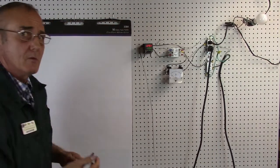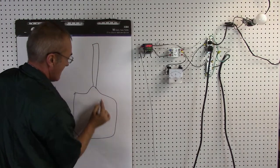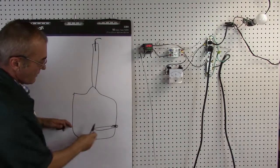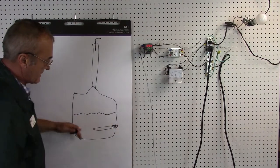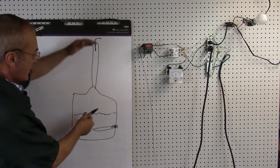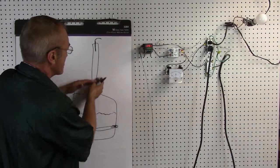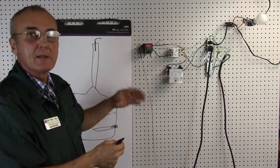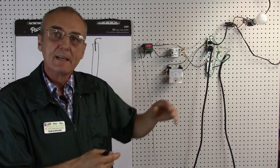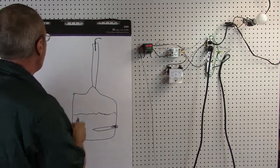It's much different if you put it into a still. If you've got a still with a column and a heater element, and you put your probe inside to measure the temperature of the steam as it's produced — there's not that much more of a lag because you're going to get the full value of that heat transfer. It's going to start to rise; at the very beginning your PID is going to stop, the temperature is going to continue to rise, then start to drop back down. Then the PID comes back on, and it's going to use its integral and derivative process to provide the proportional control to maintain a steady temperature at your set value.